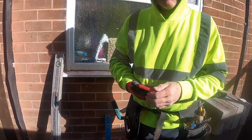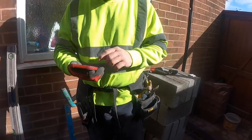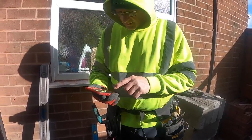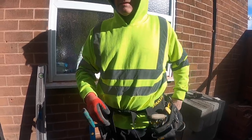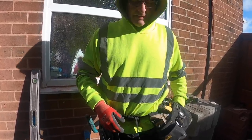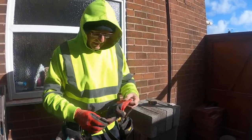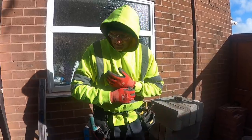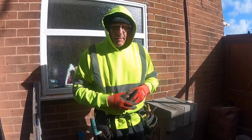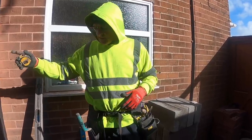So we're picking up 10 mil? No, it's the imperial bricks. Oh, yeah. 85.4, yeah, that's right. I used to set them 85 mil. And it works out alright then. So every couple of courses, an extra bit. So we'll keep it to 85 for now, that's easy to remember. No back gauge. So we might as well go back on time lapse now.